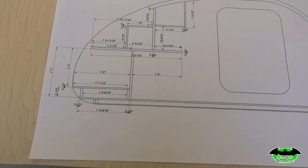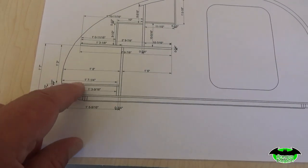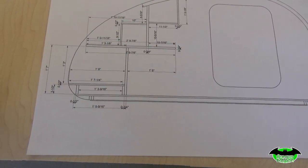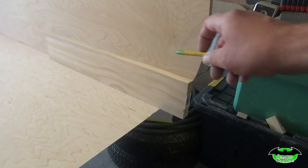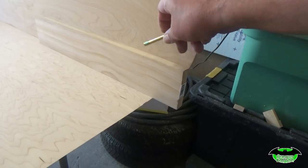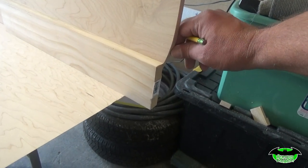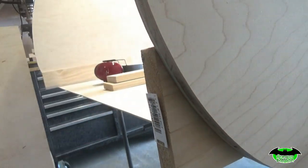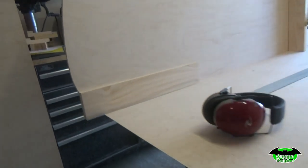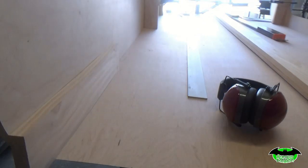This is the section we're going to be working on right now. We'll get the floor prepared, and we'll probably have a 12-inch opening for our storage bins. You should have two pieces cut at 19¼ inches, with the corner of the board set flush with our wall. Then we're going to scribe across here, get that cut and sanded down to the shape for our sides, and we're going to do that to both sides.